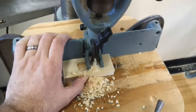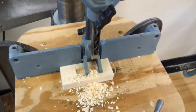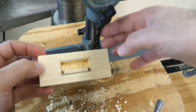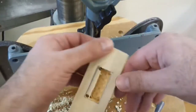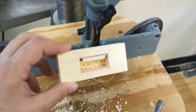Line that up carefully and push through. What you will find is a mortise like this. Now, it doesn't cover the whole thing, as the biggest bit I have isn't 3/4 of an inch, which is the size of the opening. So I'm going to have to spin this around the other way. Notice I haven't gone through the bottom — I'll go over that in a minute.